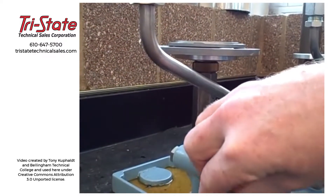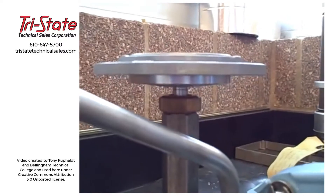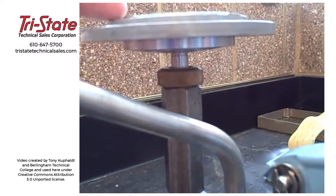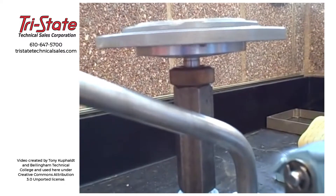It's good to spin the weight so that we break any static friction free. There we go — the weights are now risen up. We can see right here it's actually suspended only by the oil pressure. We can go up and we can go down, meaning the weights are mid-travel.